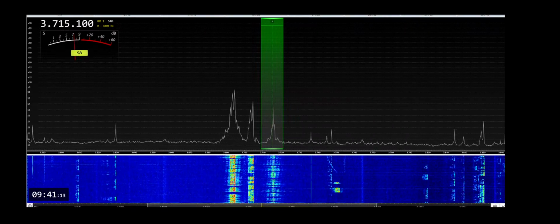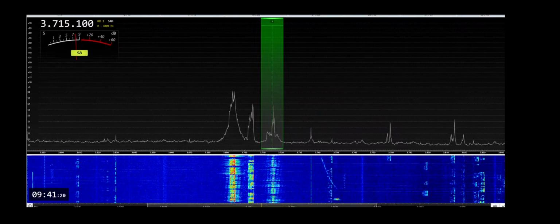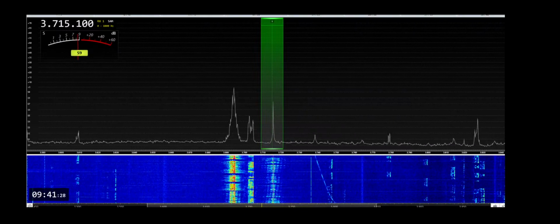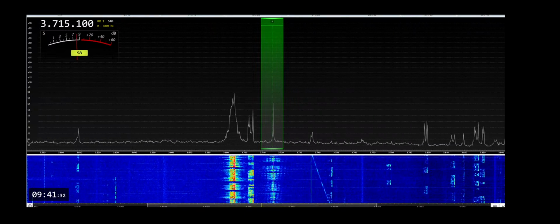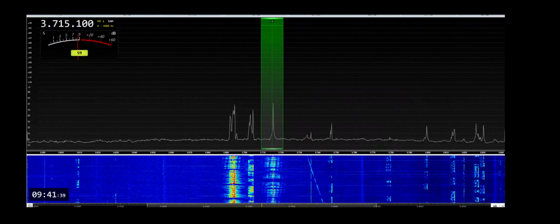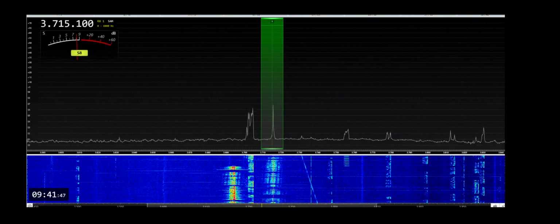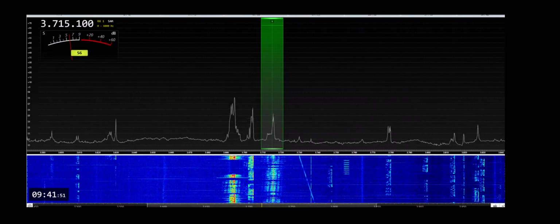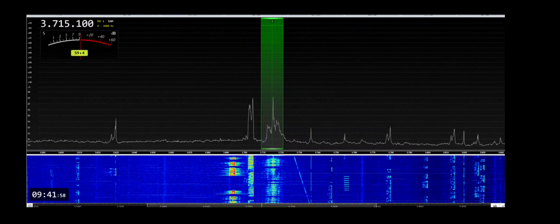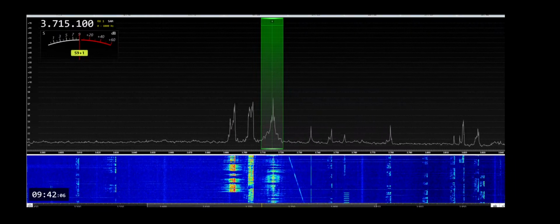I'm looking at power out as well as plate current and grid current. And grid current really is what I keep a real close eye on, as well as plate. And with the homebrew 811s I'm running now, this came out of a 60s edition of the handbook. I can see my 811s, and they're no color at all. And in the article, they said run them up to 350 mils plate current with 1500 volts, and I'm not anywhere near that. I'm running a little over 125 idling, and grid current's kicking up to maybe 40 mils or so on the meter. It may be a little higher than that. And on the modulation indicator, looks like I'm kicking at 100% there, and I'll put about 5 watts into the linear out of the AF-68.